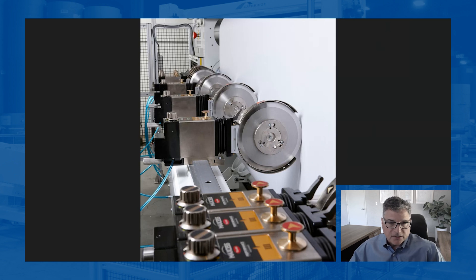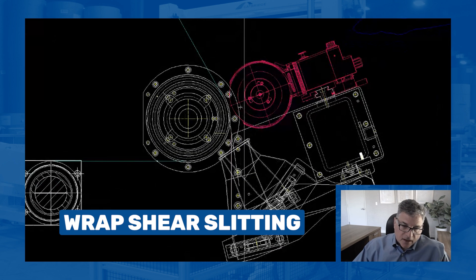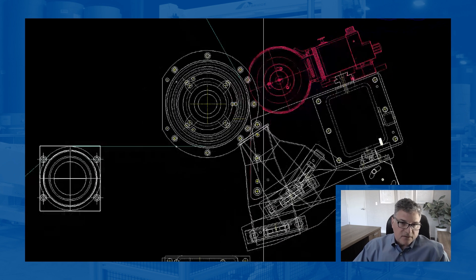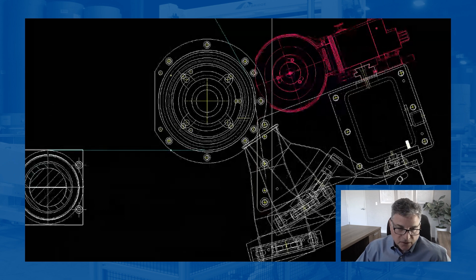When we go over these applications, we typically ask questions about the material types, the speed of the machine, the trim widths, etc. This is an example of wrapped shear slitting. The material — in this case paper — is coming in around the roller and wrapping around the shear shaft. We have a slitting knife holder right here going into a multi-ring groove. The trim pickup tubes are right at that point, pulling off the material — a short distance for narrow trim at very high speeds. This is a 6,000-foot-per-minute machine, and we're managing the trim right into the tube to prevent breakage.